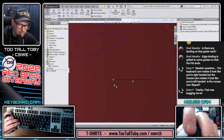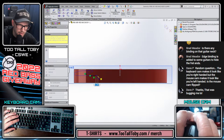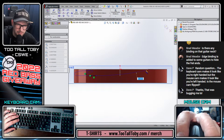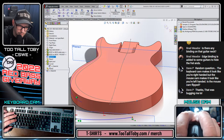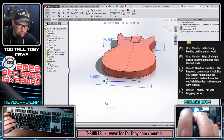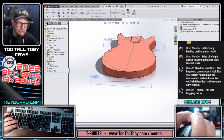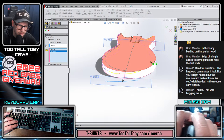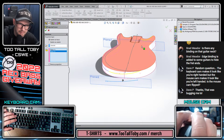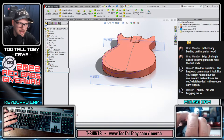I know there's a gap there, but we're going to do a fit spline. And when we do the fit spline, we'll fill in that gap. So we don't have to worry about it too much. And then it basically just curves up and ends up connecting to this point here at the other side. All right, so now we can exit that sketch and we can go features, curves, projected again. And we can project that curve onto this face and this face. And once again, we're having the curve kind of wrap around. They are disconnected this time, so I'm not going to worry about it as much